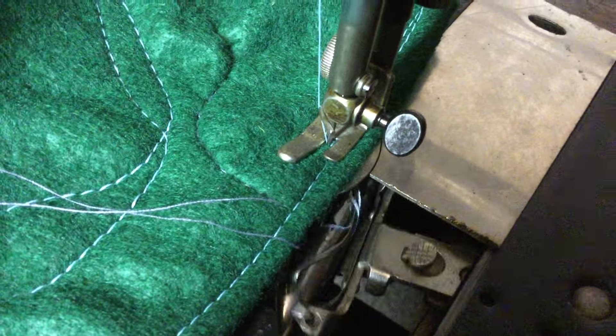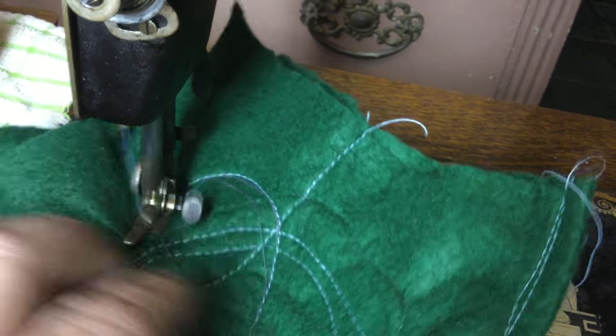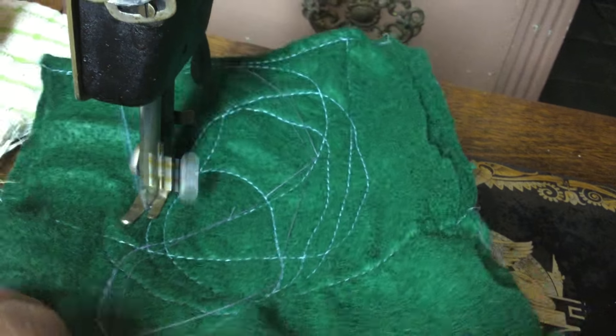Checking for skip stitches — looks pretty good. The adjustment is all right. We'll flip the machine back up and tighten the screw down that holds the carrier to the carrier lever. Much quieter now — no clunky clunk.